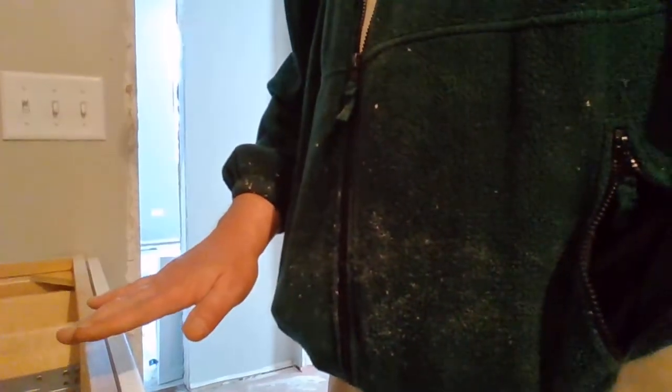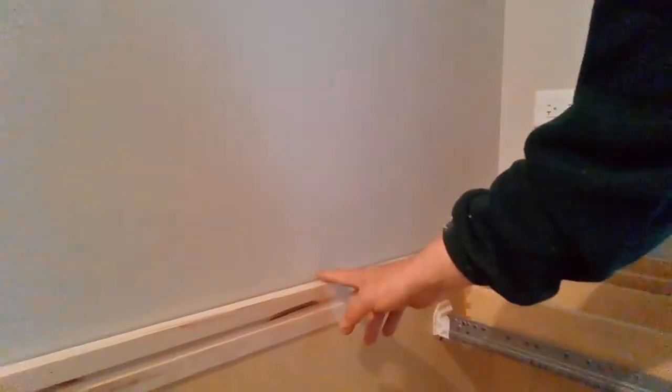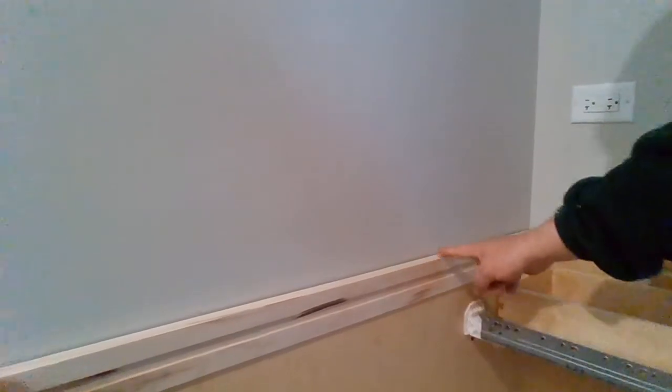Anyway, you guys have seen enough screwing this to the wall with me. Now remember, there's a top going on here that's going to be an inch and a half thick off the top of the countertop right here. And then usually you have a backsplash, which is around 4 inches. So you figure you're probably adding four and a half, five inches to the top of this in the back here. I'm going to find my layout just with a nail right along here, but as long as I keep it right above the cabinet, as soon as I install the countertop you'll never see it again. I'll give you a picture when it's all said and done.